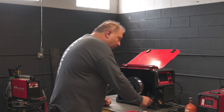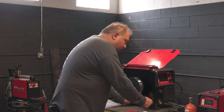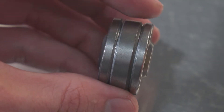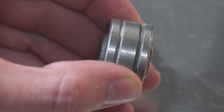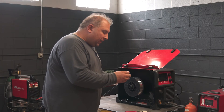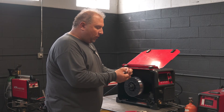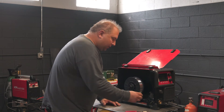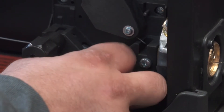In order to feed the wire correctly, we need to install a drive roll for aluminum. The drive roll for aluminum has either a shallow V or U groove roll — it's a larger groove, not as narrow as on a steel wheel, which hugs the wire more than forces it. It's labeled 1.0A for .035 and 1.2A for 3/64 wire. You want the 1.0A facing you. Clock this with the key, install it, and put the drive roll retaining screw on.